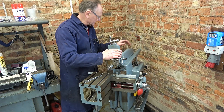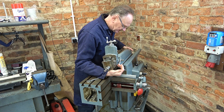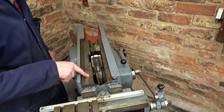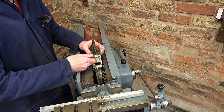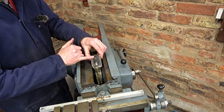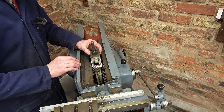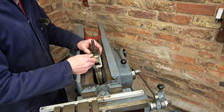It's quite heavy so I'll try not to fall over things. You can see at this end how the ways are still scraped, but at this end they've become polished, so I'll just give them a bit of a scrape. This top knuckle seems to be fine. I had a problem with it — there's an oiling hole and a little reservoir and I found I could fill that with oil but no oil would run in. So I made a small cross cut on the bottom of this eye here, and that helps. The machine is from the 1960s, and I just thought that was an improvement.